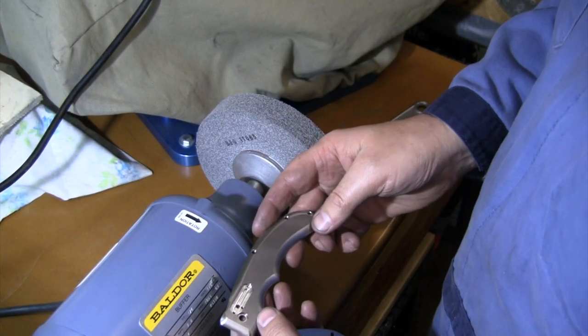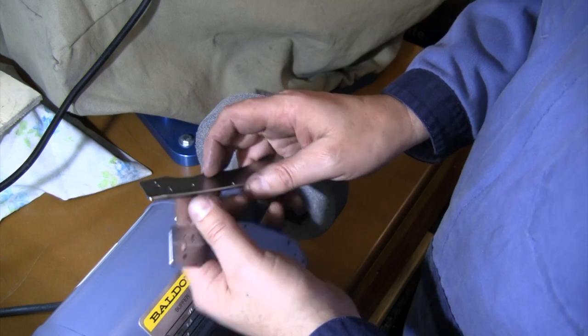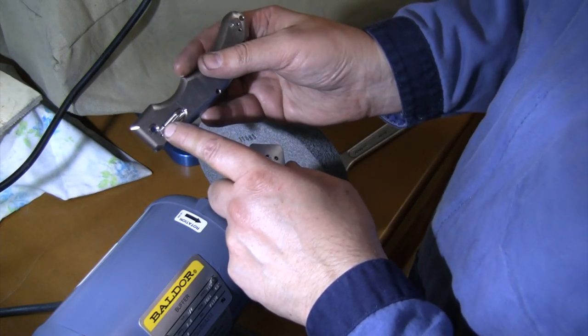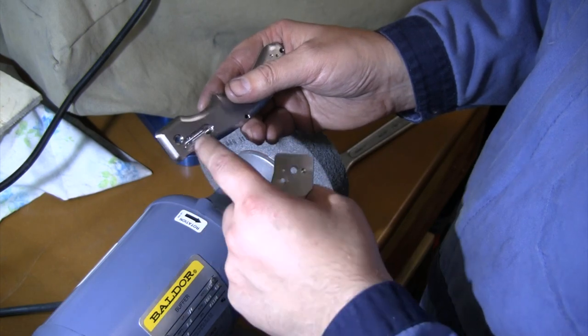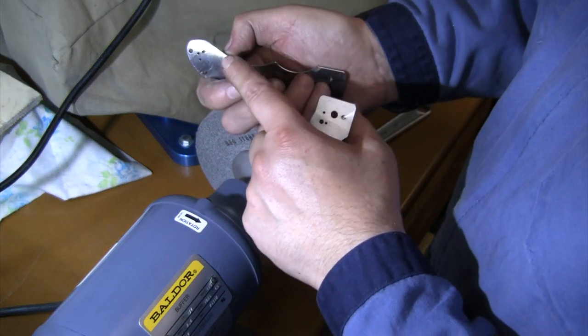All right, well, we're not having the most productive day of the shop today, as I was able to finally tap 3 of these holes by hand. So I got 3 of those tapped by hand. I was able to get the broken tap removed out of this hole right here, not quite as deep. Pretty much used a spring-loaded center punch to snap on it and just pulverize the tap, broke it up into little pieces, and I got that one out of there.